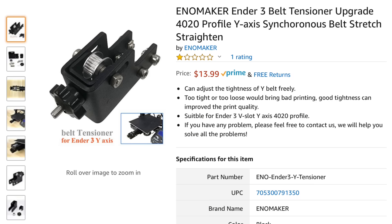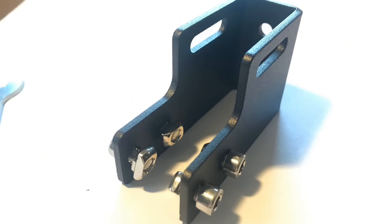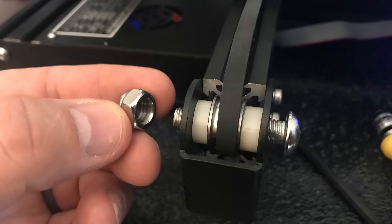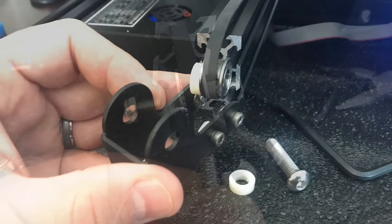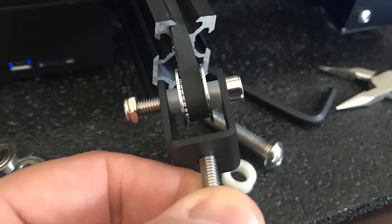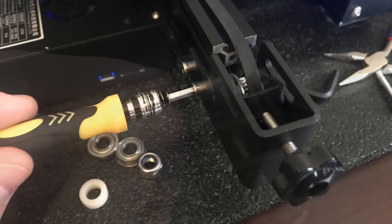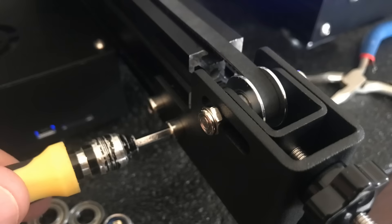With the X-axis installed, the next step was to install the Y-axis. I found this tensioner and it turns out it comes fully assembled, but I wanted to take the pulley out of it, so I disassembled it and put the T-nuts on. Then I went to the Ender 3, uninstalled the original pulley, took that bracket off, installed the pulley for the new one, and put the bolt just partially through. Then I mounted the bracket with the adjuster in between and put the adjuster screw back on.